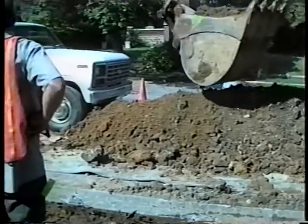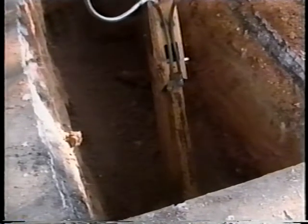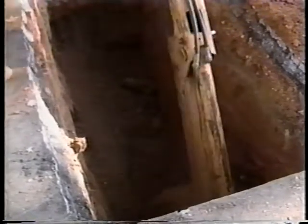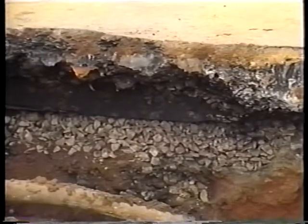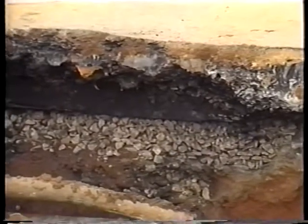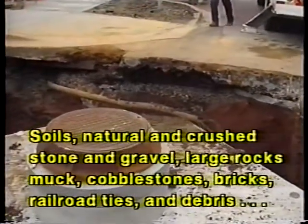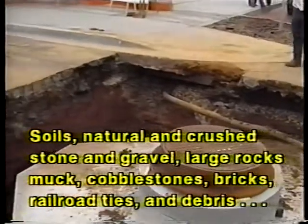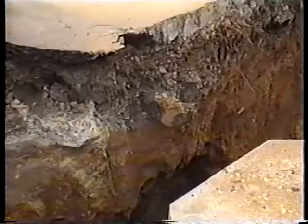Backfilling normally suggests putting back the material that was dug out of the trench, and generally that's the case. The fill material should match the subgrade of the rest of the roadway, if suitable. But sometimes certain subgrade materials are okay only as long as they're left undisturbed. Once excavated, their properties make them unsuitable for reuse as backfill. There's quite an assortment of materials underlying our roads and streets, especially in older urban areas — soils, natural and crushed stone and gravel, large rocks, muck, cobblestones, bricks, railroad ties, and all sorts of debris. Such materials must not be included in the backfill but must instead be discarded.